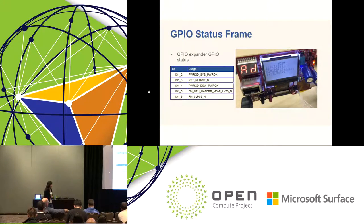The next frame is the GPIO status frame. These GPIOs all come from the GPIO expander mentioned earlier. You can connect signals based on your needs — there are eight GPIOs available on that expander. The debug card retrieves the GPIO information via communication with the BMC, which knows what signals you connected because you designed the board. The BMC sends the GPIO description to the debug card so it can display the correct labels.